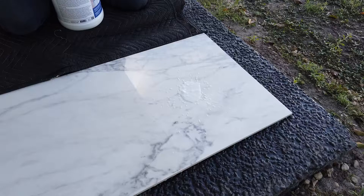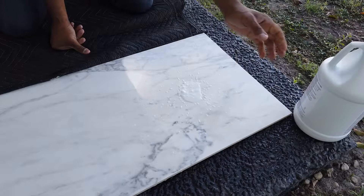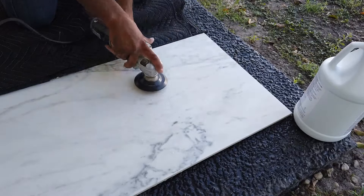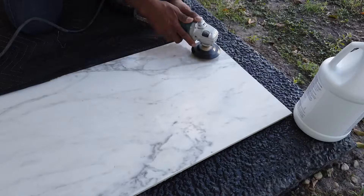This product here is the main ingredient in the process. The diamonds or whatever you use in the beginning to get rid of the scratches and bring the shine back up are very important, because not all diamonds or products are created equally. But this product is the key ingredient — this is what gives us that glass finish. It's used a lot on porcelain, but you can also use it on granite, marble, and all other types of stone.